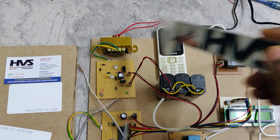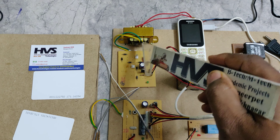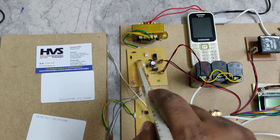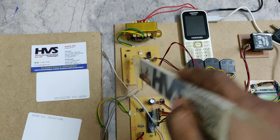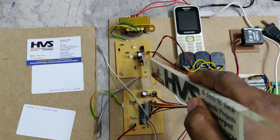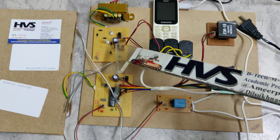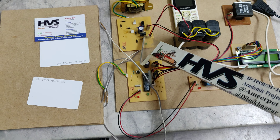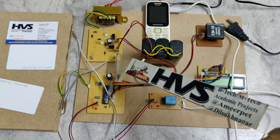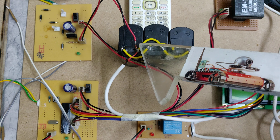From here we provide 230 volts, and after this transformer, 4 diodes are connected in a bridge rectifier manner. After that, pulsating DC comes to this capacitor, from which you get pure DC. After the 7805 regulator, we are going to charge this battery with 5 volts.